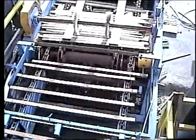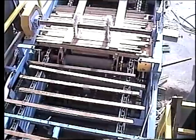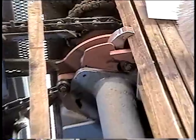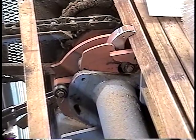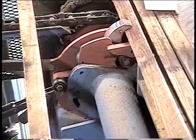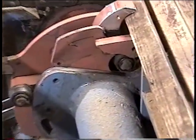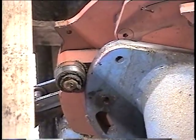To complement the operational reliability and flexibility of the feeder, Gillingham Best has developed an extremely rugged mechanical design. Each rotating star wheel features four tongs. Each tong is mounted on a rotational bolt. The bolt is not cantilevered as in the original PLC design. Instead, it is supported on each side by a steel plate.